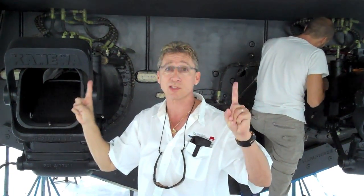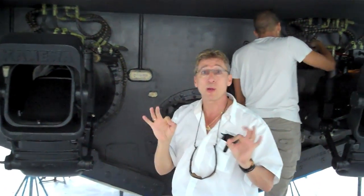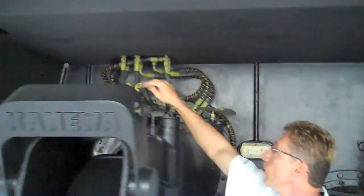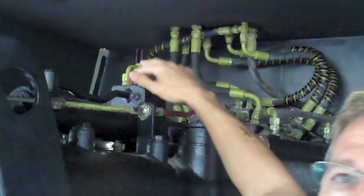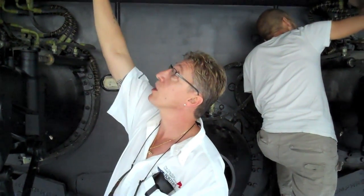You have two different products when you're doing go-fast boats. And if you can look behind me, we even went one step further — we wire-wheeled down all the hydraulic fittings and put on Prop Speed so that there's no growth there. We don't have the thick coating of priming and bottom paint because that's dragging. It starts to get really built up when you have a lot of growth. So: Prop Speed, Trilux, VC Offshore when doing go-fast boats.